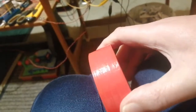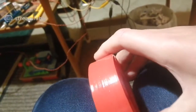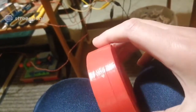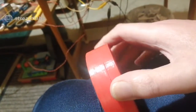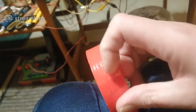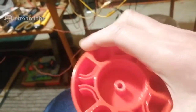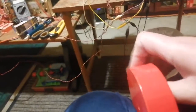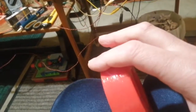I did get some slight cracks just starting to form, but I was able to rescue it before it failed on me. If I'd gone to bed and left it, and it had cooled on the print bed without the acetone, it would have opened right up. It would have split right all the way around, because that's what happens with ABS when you're printing a large, tall object. The bottom's heated, so the bottom starts to shrink a little bit because it's drying the plastic out.